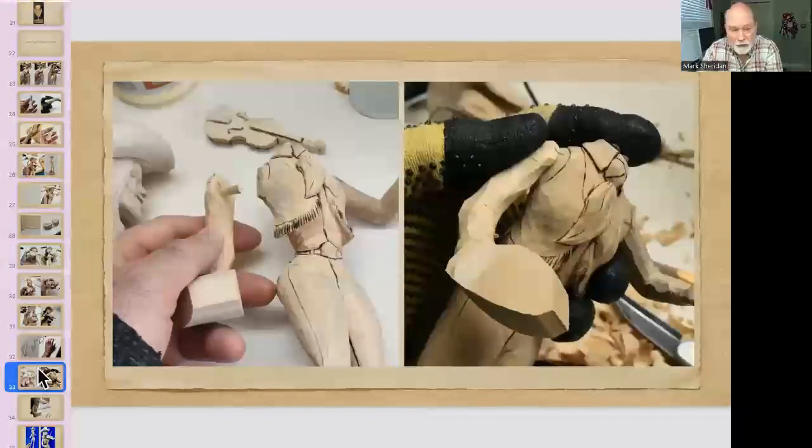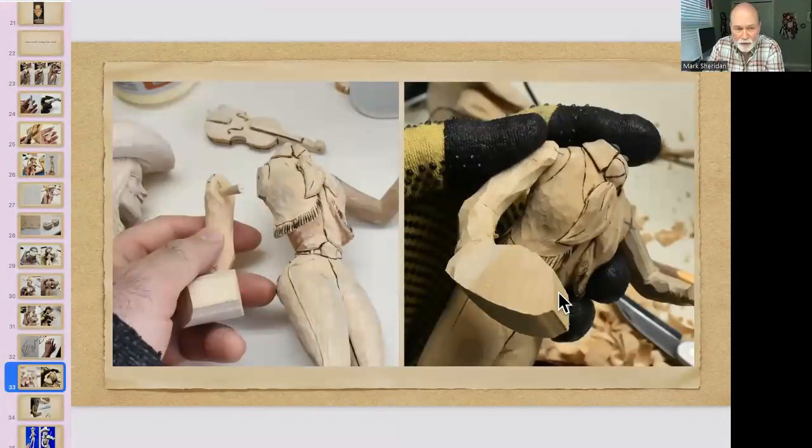Okay, then I worked on the next arm. I did it exactly the same. Well, I didn't do it the exact same way. It's the same principle. I used a dowel. I marked off where the arm was going to be after I matched it where I wanted the bow to be. And then I put graphite on one side. I let it show up on the other side. Once I put the two together, I took off the high points where the graphite was transferred, and I did that 3 or 4 or 5 times.